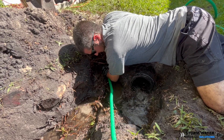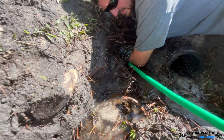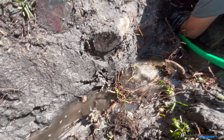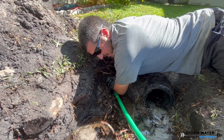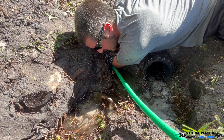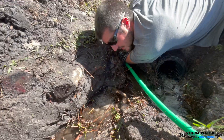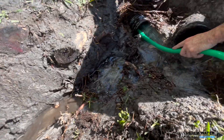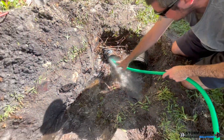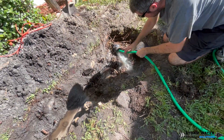There's really no point in replacing this main line and doing all this work if you have a small section of pipe clogged up for a downspout. It's a lot easier to get that cleared out now while everything is opened up and we have a trench — just let the water flow down the trench and make its way to the road. This hose jetter works tremendously for small jobs like this. For anything bigger with more sediment and debris we'll use our pressure washer with our jetter, but for stuff like this the hose jetter is easier — it's just a nozzle that goes on the end of the hose.